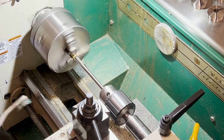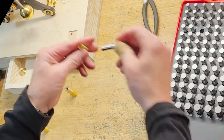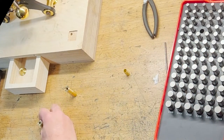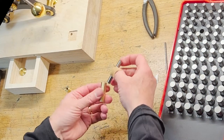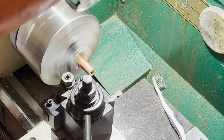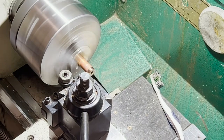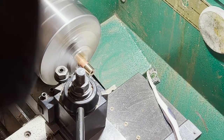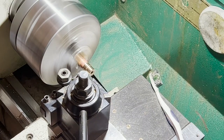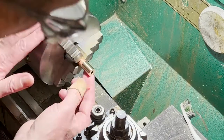I'm speeding all this up just to really show the steps of how to make it. I've got this hoop and I use these gauge pins — so handy to have — and now I know the exact diameter I need to turn it down to make the hoop go over the piece. I'm machining it on the lathe with really light cuts to make sure nothing grabs, since that silver solder I think of as just tacking everything together.